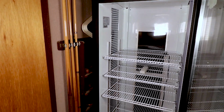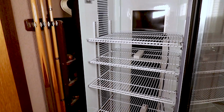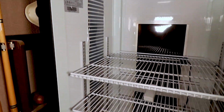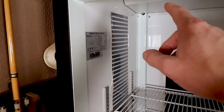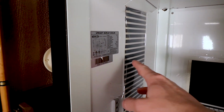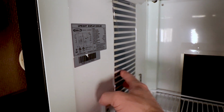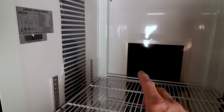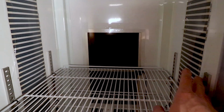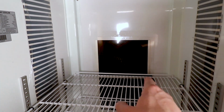And on this one, you can see more of what I have as far as how I built the incubator. So the first thing you want to do, whether you're doing a refrigerator or something like this, is measure from the top to the bottom, and then you can get this heat tape from Reptile Basics, and this plugs into your thermostat. What I found is it's better to do all three sides for the heat tape and control it with a thermostat from all three sides.